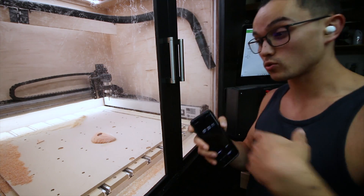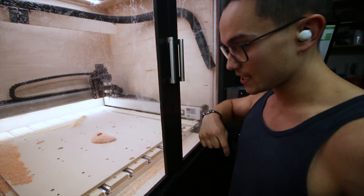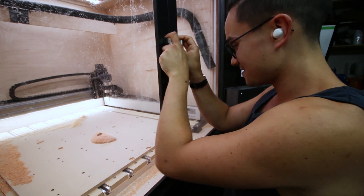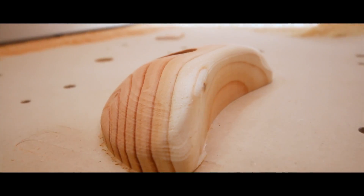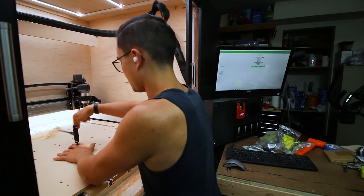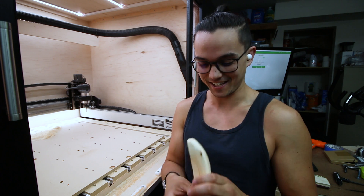The finishing time added to the roughing is clearly longer than what I'm estimating in the CAM. The main reason they aren't coinciding is that even though I'm setting the machine to run at 200 inches a minute, it only really hits that in pure XY travel — the finish is Z-limited because my Z axis doesn't move quite that fast. But this hold looks gorgeous. My card got full as I was in the middle of trying to finalize what I was describing — it's clearly been a long day at the machine and at the CAM.